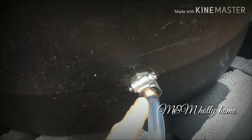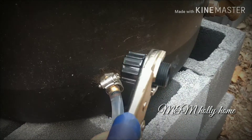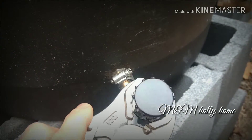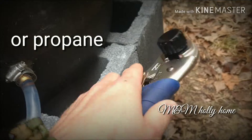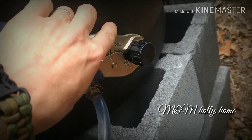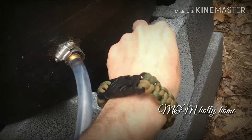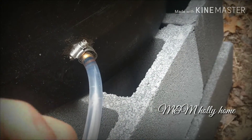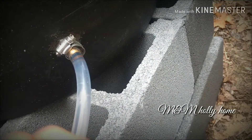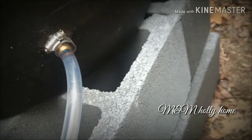What I did with these barbs instead of drilling the hole and running a tap in there — I took a pair of vise grips and gripped the brass fitting. I took a map gas torch, heated the brass fitting nice and hot, then took it to the barrel where I wanted the hole and pushed it in and wiggled it, which melts a hole right through. I pulled it out quick, grabbed a brass fitting, and turned it into the melted plastic. It gives you a little more surface area to lock the brass fitting into the barrel — when you have the melted plastic around it, you have a little extra meat in that plastic to lock that barb in.